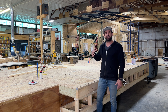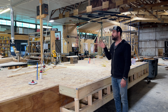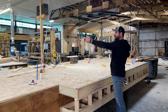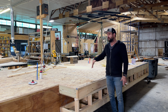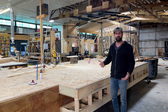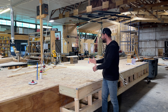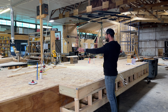Once we have everything in the floor, it's time to lay down all of our plywood sheeting. A couple of things to keep in mind: we want to make sure we're running it as straight as possible, so we want to start with a control line. The easiest way to do that is to measure two exact same distances on each end, snap a line, and then follow that line when putting our plywood down, working forward until you get to the very end or edge of the unit. Also, when breaking our plywood on our joists, we want to make sure to keep each row's breaking points staggered — we don't want to line those all up.